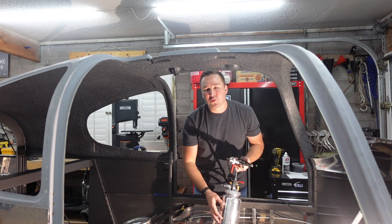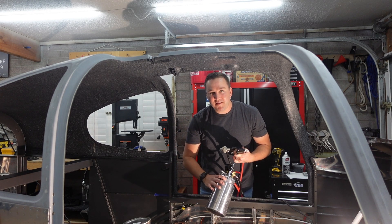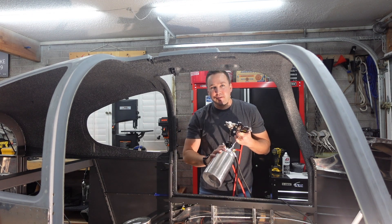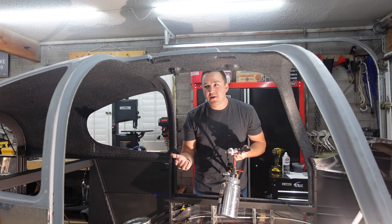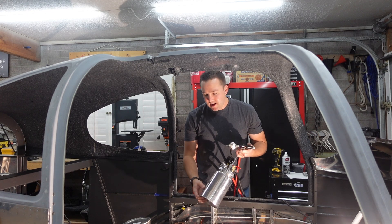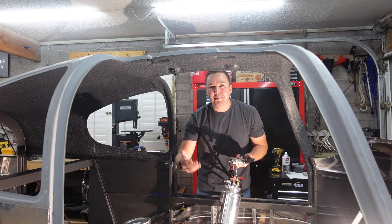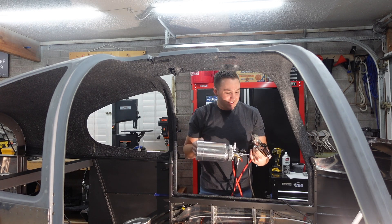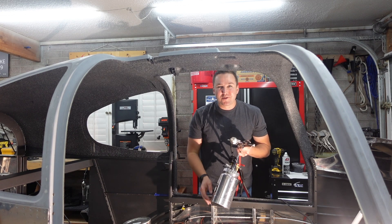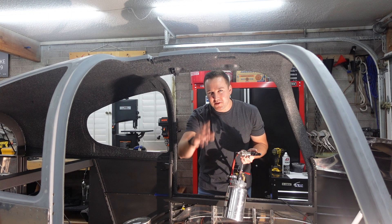If you're going to do this, just trust — test it with water ahead of time. Another thing I read in the reviews: don't use any heavy cleaning products on the tank itself. Inside is a delicate O-ring that swells with acetone or MEK. Being that Zolatone is a water-based paint, I just clean it out with water each time. I made it through a couple of different sessions and water worked perfectly. I never ended up using those harsh chemicals — something to keep in mind. Just read the reviews before you use it.